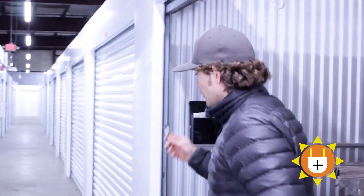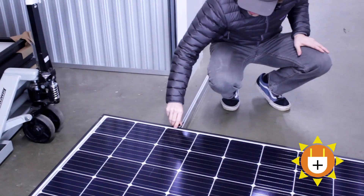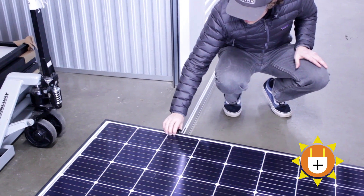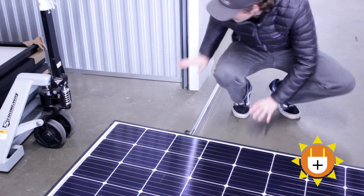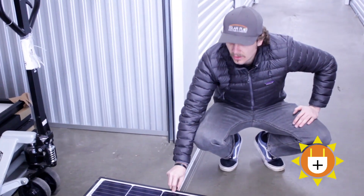If you wanted to continue this row of solar panels, you'd use a mid. The mids go right in between two panels. You'd put one panel just like this and squeeze another right under and drive this mid straight down to fix it to the rail.